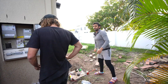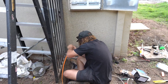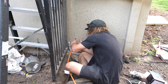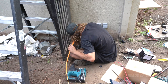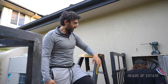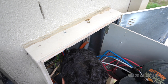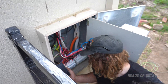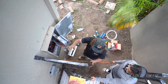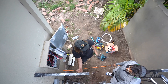That's a hard one — I'll grab the snake and give it a go. You can hear it touching the back of the board at the moment. We managed to get the snake halfway up the wall and might be able to get it further. We're on that side of the bracing board, so we need to punch through the other side — drill a bit more. The board's pushed back hard against the bracing, and now we're in the framing. There could be a flat noggin in our way that's not letting us get past.